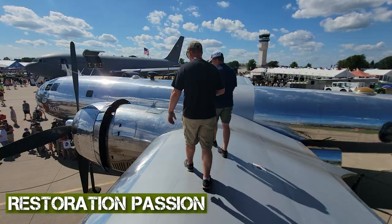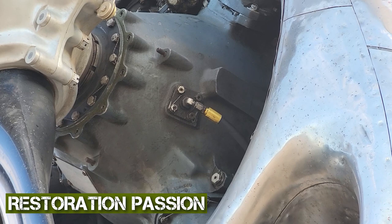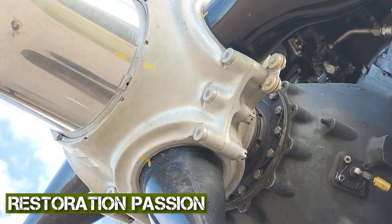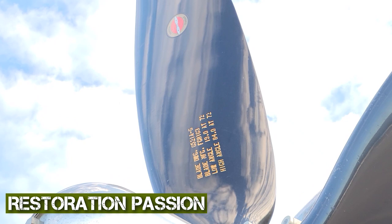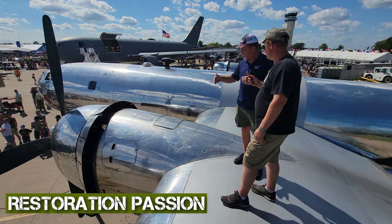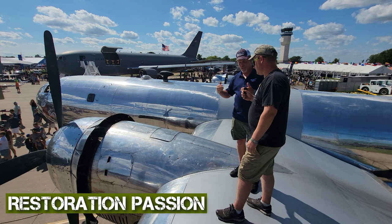So this is a Curtiss-Wright 3350, an incredibly powerful engine, especially for its day, but it was also, just like the airframe, not ready for service. Major problems with oiling systems, with cooling systems on the airplane, and that engine probably took out more B-29s than the enemy did. Throughout the war, in just the short time this airplane was in service, those two years, they had done over 3,000 modifications to this engine, trying to extend its life and bring it into service. You could plan, when this thing went into service, you're only going to get about 50 hours out of that engine before it comes apart.